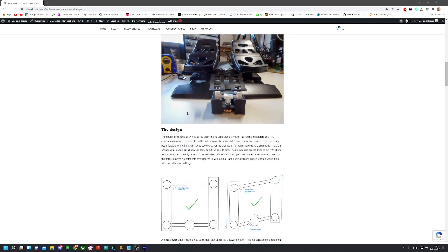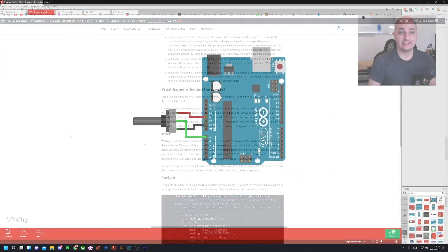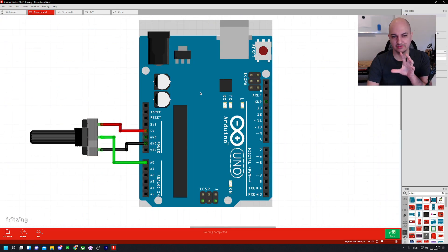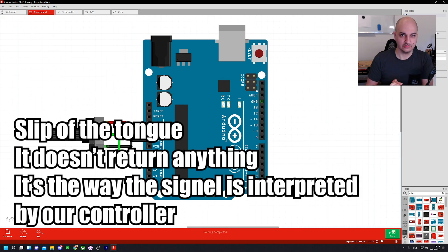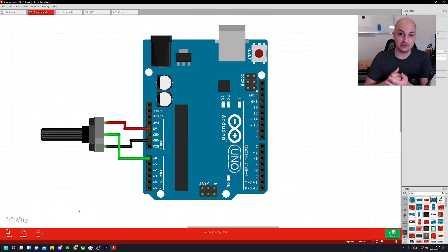On my website I'll go into this in more depth, so check out the article in the description. To illustrate how this works, I've loaded up Fritzing with the potentiometer. A potentiometer is an analog component. To understand what an analog signal is, it helps to first understand a digital signal. A digital signal returns ones and zeros — on/off, open/closed — and that's the only thing it can send. Press a button, it sends a one; release it, it sends a zero.